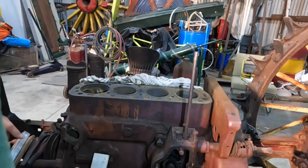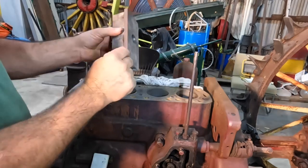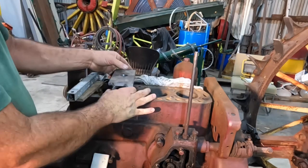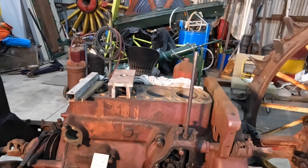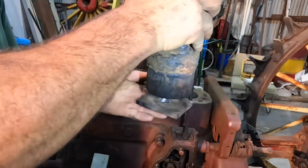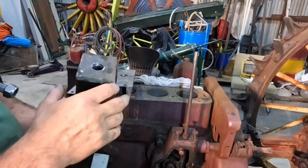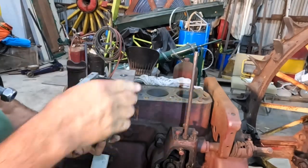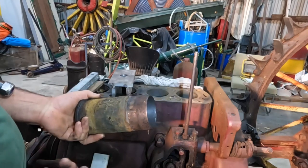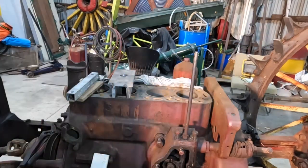The puller I made up is all out of bits of scrap from around the workshop. It's a big heavy plate — 10 mil thick — and I started bending it so I welded a couple of legs on it. This sits across the top of the cylinder. We've got a big heavy plate that sits on the bottom of the cylinder. If you go out and buy a proper puller made for this, they make nice little — I think they call them pucks — that are machined to sit just inside the cylinder with a lip the same diameter as the cylinder. This one's too big and doesn't fit through the hole in the bottom, but it works fine — you've just got to be a bit careful with it.